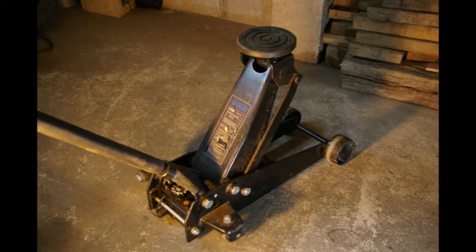My last comment is going to be on jacking inside the garage or workshop. The most commonly used type of jack for this is a trolley jack, but I would like to point out that the average trolley jack you get from a car accessory shop isn't going to be suitable — it needs to have high enough capacity and a high enough lift. I show here a three-tonne SGS trolley jack which is perfectly suitable; it will easily lift two corners of the Land Rover at once, either one side or one of the ends. The main negative of a big trolley jack is that it is big and it's heavy — this one weighs 45 kilos. I find I tend not to use this jack very much for this reason, when I'm trying to manoeuvre it around in the workshop and I've got things on the floor — spare parts, tools, cables in the way. It's just too cumbersome.